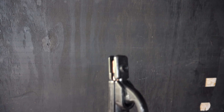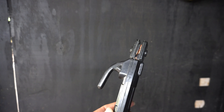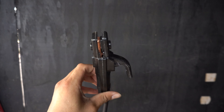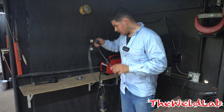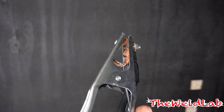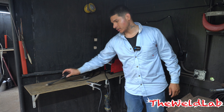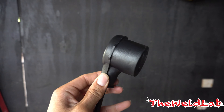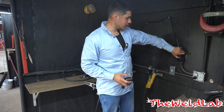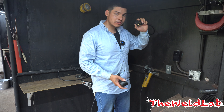When you buy this machine it comes with a stinger — it's only about five feet, so you might want to get a longer one. We got an extension for what we're trying to do today. It also comes with a five-foot ground, which looks pretty good. It also comes with an adapter so you can plug it into 110 at your house, but it's better to use 220 to get the full potential. The machine comes with the 220 plug — this is the one that plugs into like the washer and dryer outlet — and that's the one I recommend.